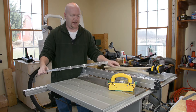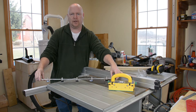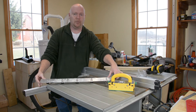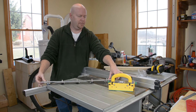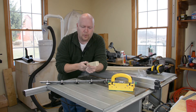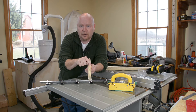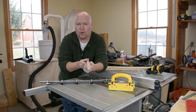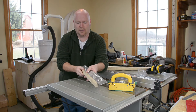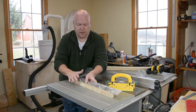What I want for this thing is I want it to sit on the floor but at a little bit of an angle. It could sit flat — a lot of guitar stomp boxes do just have a square shape and sit on the floor — but if you want to do it right we're gonna build it the way they would build a pedal board, which is about maybe a 10 or 15 degree angle. What we need to cut are some weirdo blocks like this. This right here is my prototype for the front of the pedal board. It's cut at a 15 degree angle across the top and then has a rabbet sunk at the same 15 degree angle so the top of the rabbet and the top of the board are parallel to each other, just offset a little bit. That rabbet is deep enough for the switches on their aluminum plate to sit in there, and then this whole thing sits flat on the floor — there's the front of your pedal board.